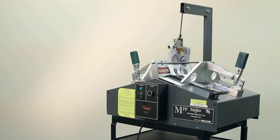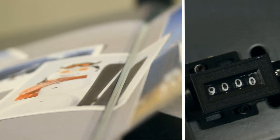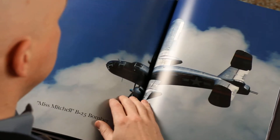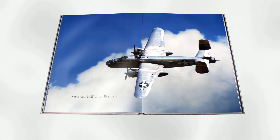Regular reliability testing is performed using the Moffitt FlexTester 40. Industry standard is 300 cycles of page turns for an acceptable binding. FlexBind pages can go more than 10,000 cycles without failing. With non-FlexBind books, the mere action of opening a book and turning the pages will put stress on the binding. The incredible performance of FlexBind will far outlast standard books.